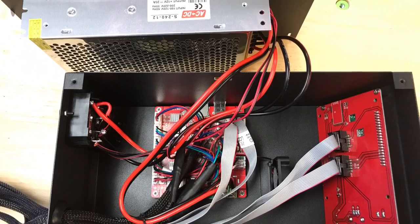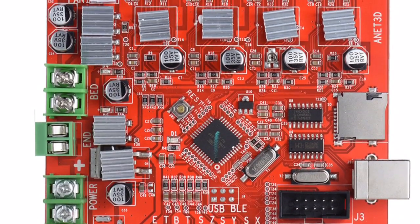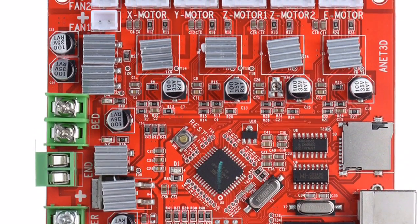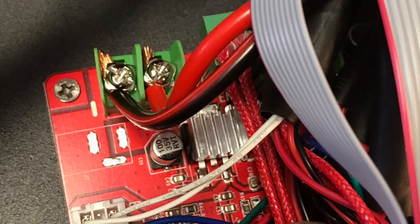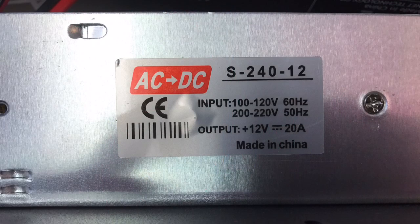When I took it apart, I didn't see any external FET driver, so it's relying on the FET that's on the motherboard. And look at this wiring to the power connector — these wires are about ready to break; this is really, really marginal. I tried to find a schematic and I can't find fusing on this board anywhere. It does not look like it's got any fusing, and that's bad, because then you're relying on that single 3-amp fuse. It is an 8-bit board — I could find on mine an ATMega128, so it's basically an Arduino board. There is a fan in there to blow across the motherboard, specifically at the FETs. The FETs had push-on heat sinks — totally unacceptable. This should be a much better heat sink. It's fine on the stepper motor driver chips, but those FETs need a lot better heat sink. It's got a 20-amp, 12-volt — so 240-watt — power supply. Not huge, but this electronics was marginal.